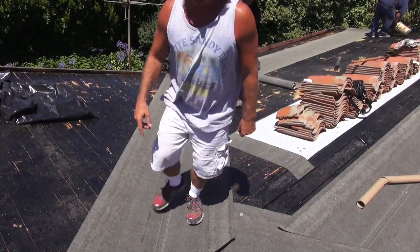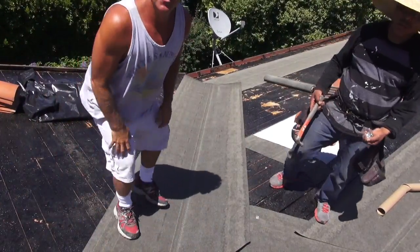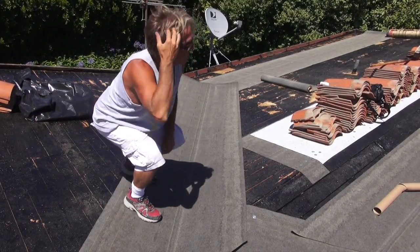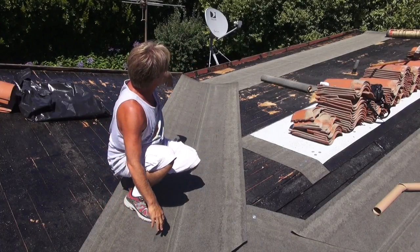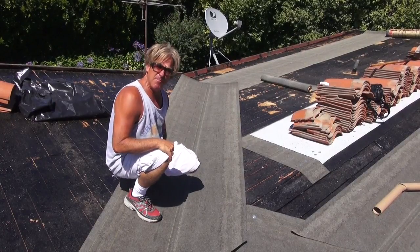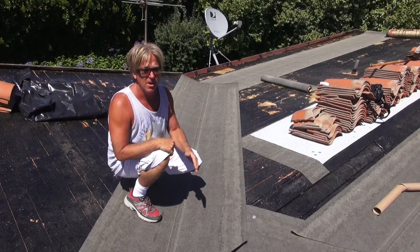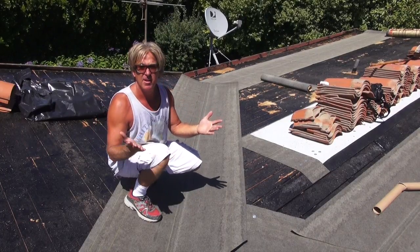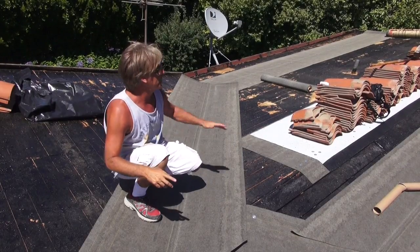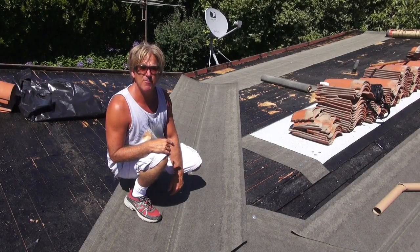You can see the lines on the base paper — that's your center mark, your half line. We want to make sure we get it down there, and then when we come back with the paper we do it accordingly. This paper in the valley had to go on top of that course right there so the water is not going backwards or bucking underneath the laps. Everything is working out great. We're going to continue doing the base paper, wrap it up, and get ready for some torch.